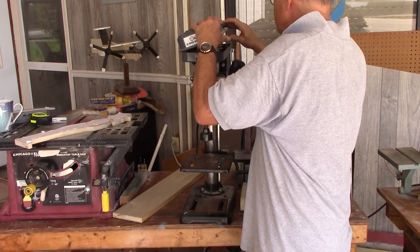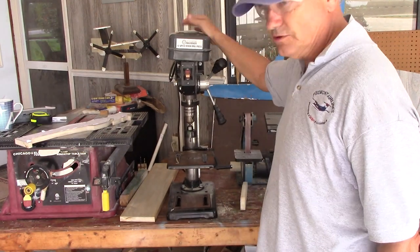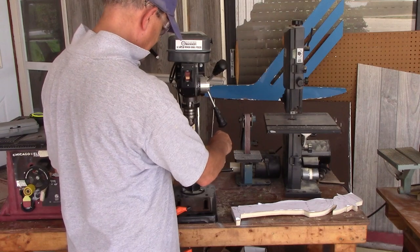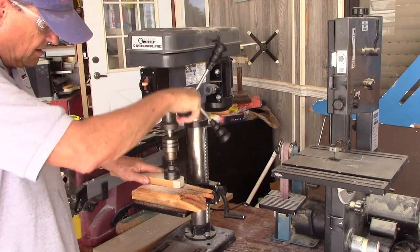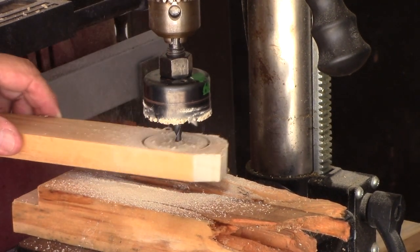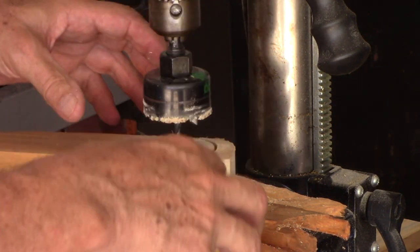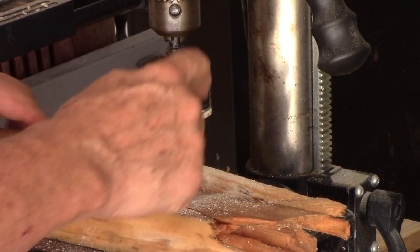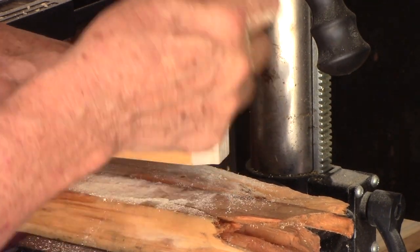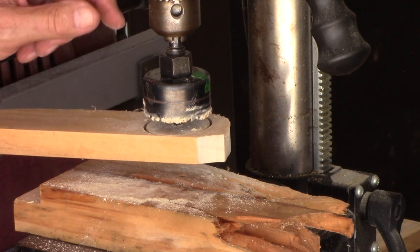This gives you a nice heavy-duty drill press. Don't go to Harbor Freight for this particular drill press. Make sure your backing under here is flat so you don't drill at an angle. I have a line drawn on this — if you let it go all the way through and cut it out, your donut piece is going to be jammed up inside the cutter and you'll have to hammer it out. What you do: drill it down slightly more than halfway, flip it over, and finish the last little cut. That way you can just slide it right out, saving you a lot of time.